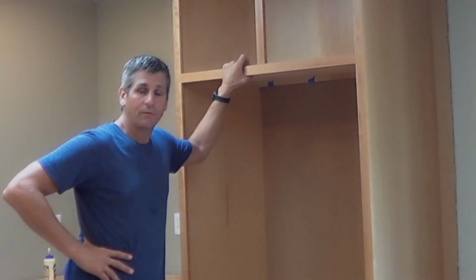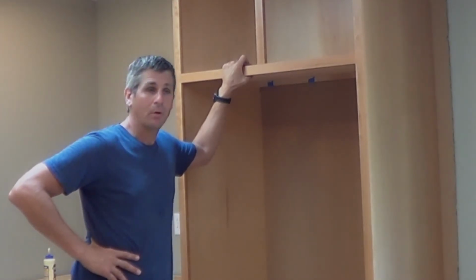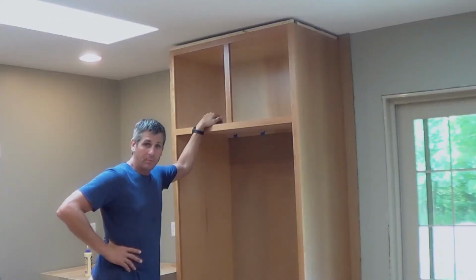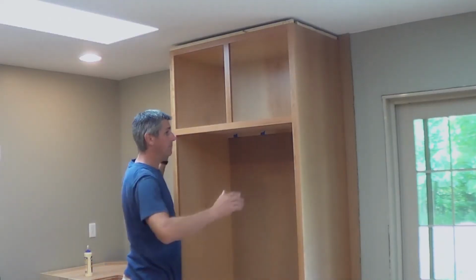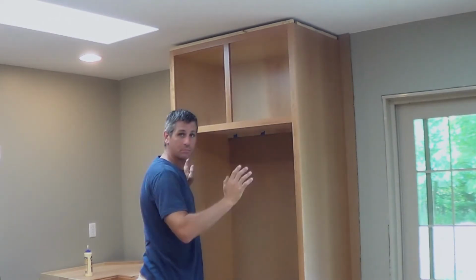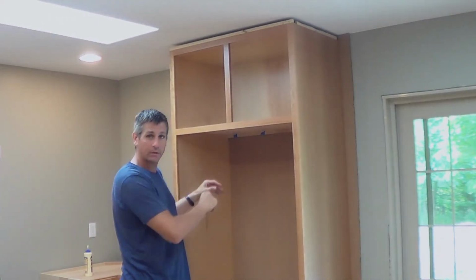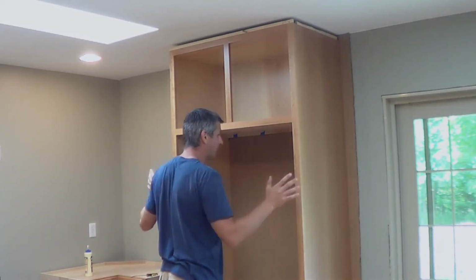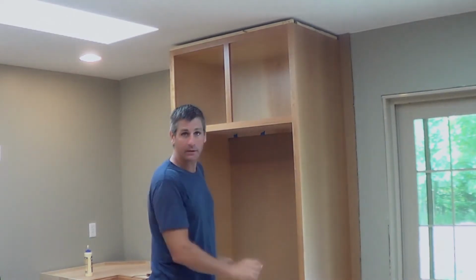Alright, so after a little fuss and muss, Mark and I have this cabinet built. We spun it around to show you how it'll be installed. A couple little tidbits for you here. Tidbit 1, make sure you take your mallet and reconfirm your front frame is mounted, because in all the jostling around, sometimes the frame will work itself off the cabinet sides. So this is a good time to go back with the back against the wall and just tap your front frame on.